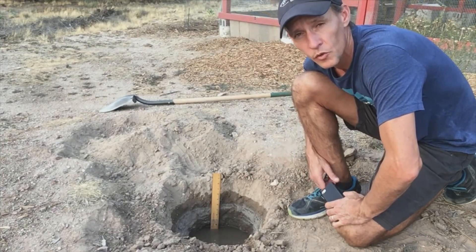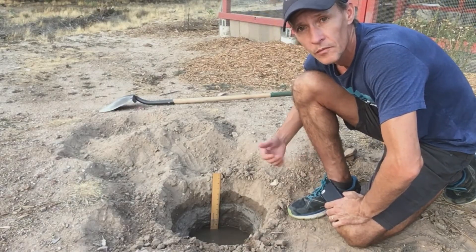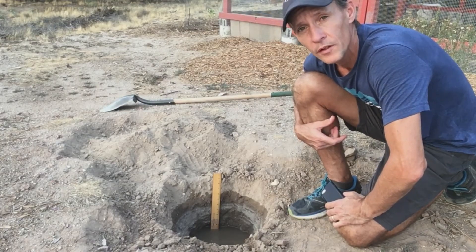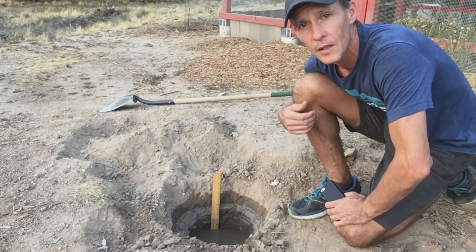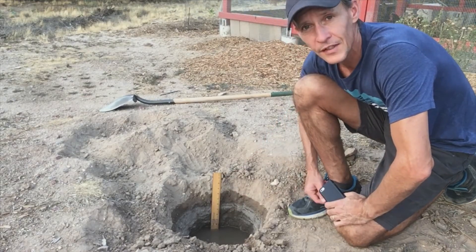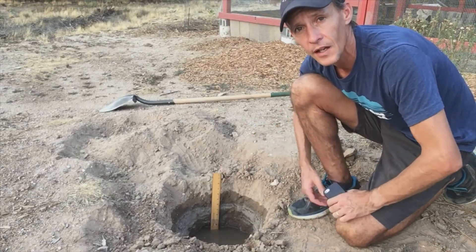Typically when there's more clay, it can be as fast as two inches per hour or as slow as half an inch per hour or even slower. If it's going to be that much slower — say one inch per hour — then we wouldn't want a basin more than 24 inches in ponding depth, because that could mean 24 hours or more for water to fully infiltrate. Here at six inches per hour we don't have a concern, but with a very limiting rate, you need a shallower basin to safely get that water into the soil.